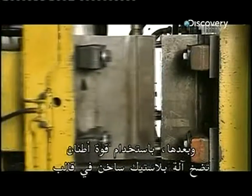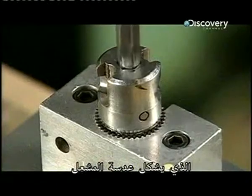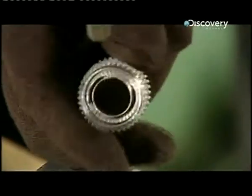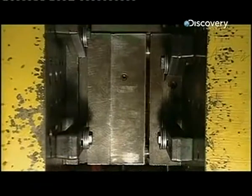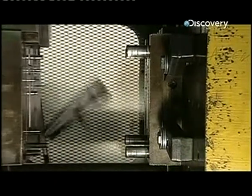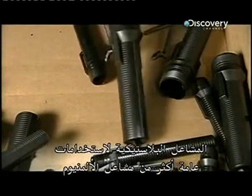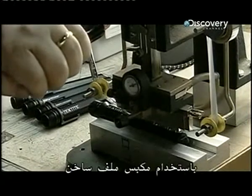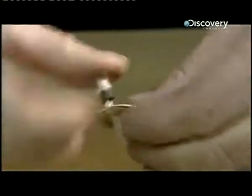Using tons of force, a machine injects hot plastic into a mold which forms the lens for the torch. The lens is placed in a jig and the mold core unscrewed — the core has formed threads in the lens so it can be screwed onto the torch body later. Another injection mold is used to make plastic torch bodies, intended for more general use than the aluminium ones. For custom orders, a logo is stamped onto the torch using a hot foil press.